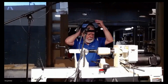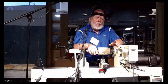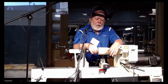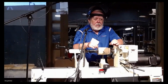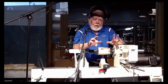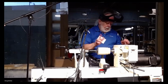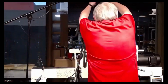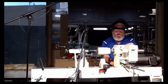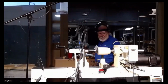So at the retreat, and we'll talk more about that later, everybody's carrying in carbides. I started watching them, and out of respect, they turned slower at the retreat. It made me happy. But they were putting tremendous pressure on the piece of wood, and I'll show you what happens. I'm going to back it off. We're at roughly 600 RPM.